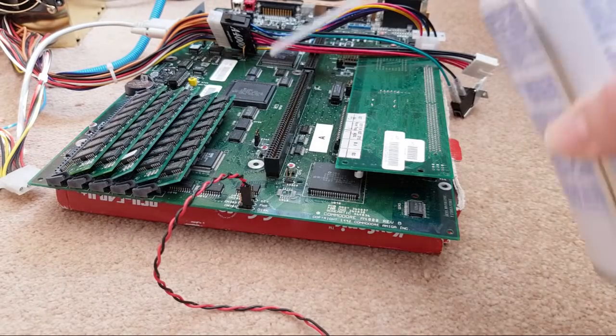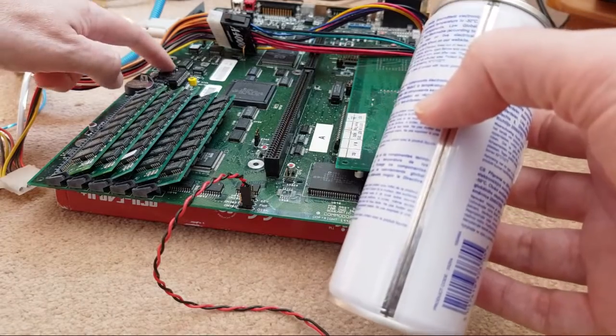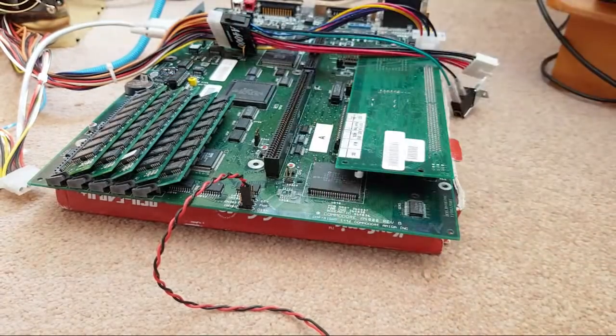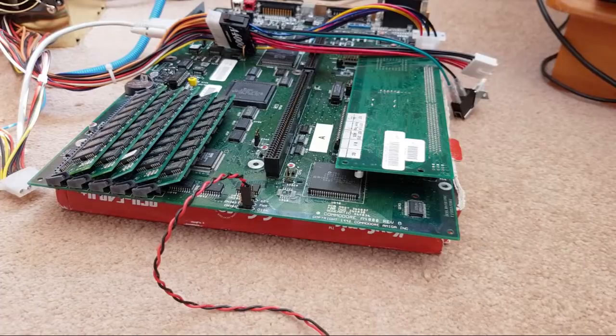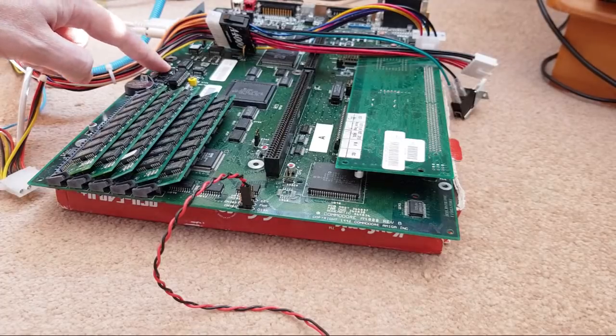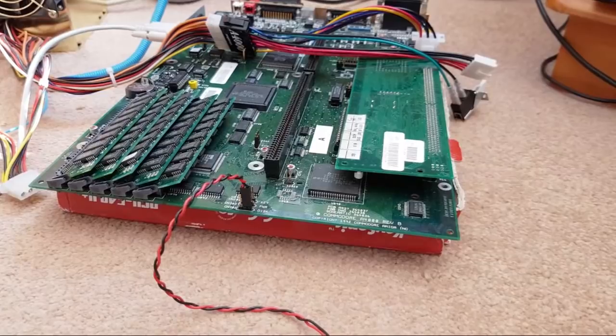So I did this last time. This was what gave me a clue that it's the shift register there. I thought it was a bad solder point, but I don't think it is. And I just pointed that down, sprayed it, powered it back on and off, and it worked fine. Now I found that same thing last time, so it is to do with the temperature again in here. It's warmer, and either there's a bad connection, not on the register, the one on top there, that shift register on top is for the option jumpers. But hang on a sec. Hang on, guys.